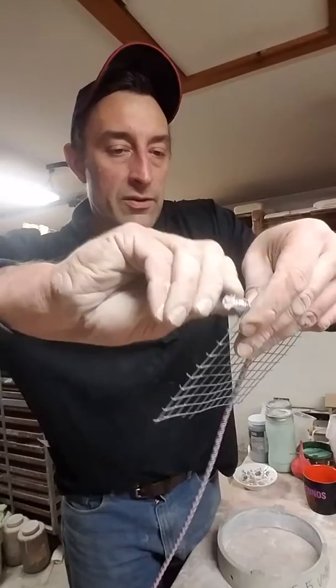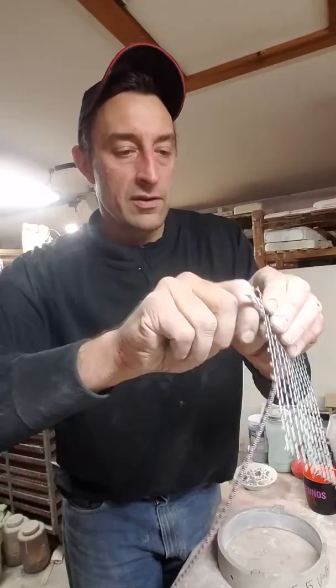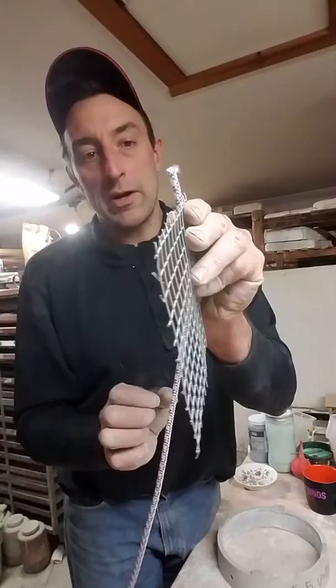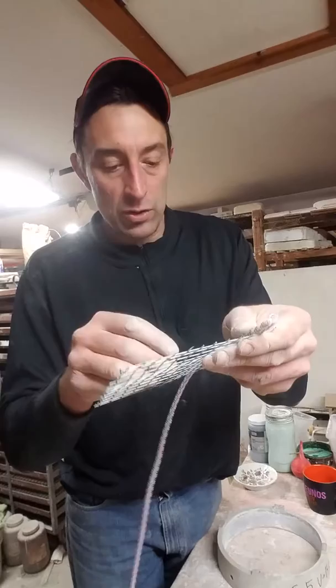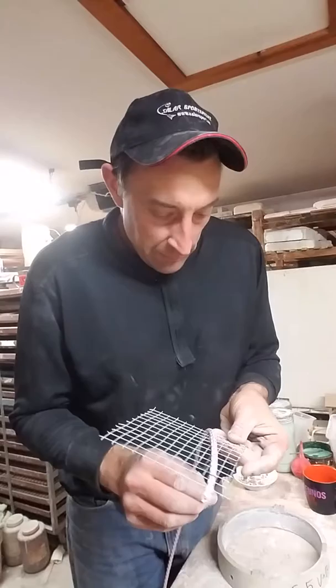You just take your wire and wrap it around — you attach the mold duct tubing to this mesh. This garden wire makes it really easy. You want to keep the piece of mold duct tubing sticking out about an inch. When we end up putting this inside of the mold, we can move it a little bit if needed.